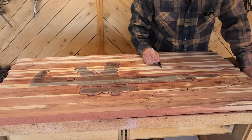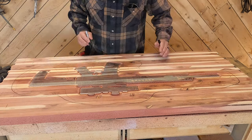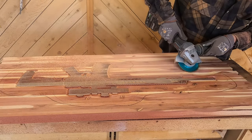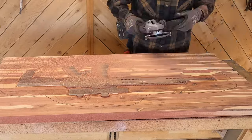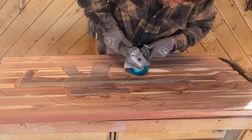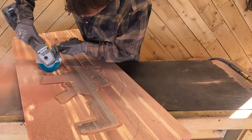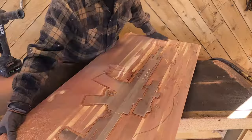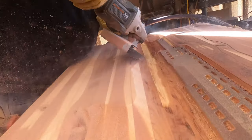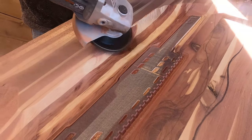It's a good idea to start out with pencil, which is what I did — it took me three separate tries before I liked what I saw. Then I traced it with a Sharpie to make sure I could really see what I was doing. I started off with a medium coarse disc on the grinder because this is cedar and I didn't want to take too much off too fast, but there were some pretty hard spots, and eventually I switched over to the extreme coarse disc. I wanted a very abrupt carve — I didn't want it to be gradual or smooth. So as I brought the grinder towards me I really angled it up; I wanted it to almost look like this thing's exploding, and I think it does.